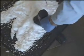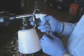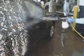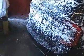Unique application here, battery operated NiCad scrubber. The amount of foam is regulated by the air pressure valve on the handle. When the air pressure is turned down, a small amount of foam will be delivered. When the air pressure is raised, a higher volume of foam will be delivered.